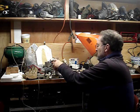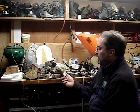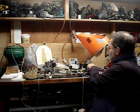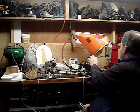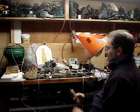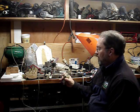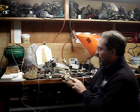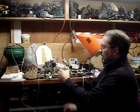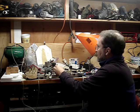I went out to a scientific supply and found a Pitman motor — a 12 volt motor. You can see from the bench that I was experimenting with a 12 volt supply, and you can see from my hopper that I ultimately ended up with a 110 volt motor. This Pitman motor would have done the job very adequately — lots of power, lots of torque, the right shaft size for driving — but again, the basic problem was it turned too fast, about 50 RPM.